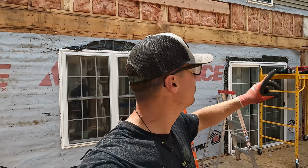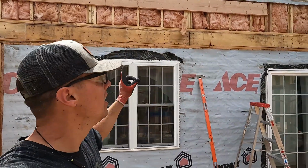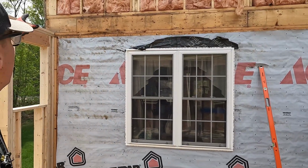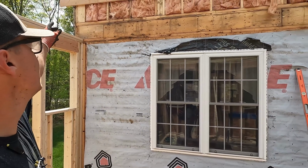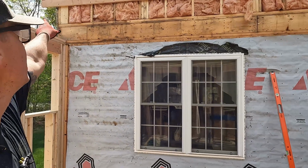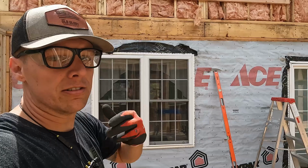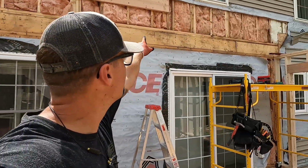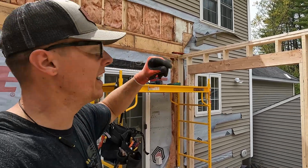So our walls are all done. We stripped back where our ledger is going to go, and we actually have a long part of our ledger on there. We have a 1 foot overhang from the first rafter, and then our layout's on there, 16 on center. We have 6-inch timber locks in each bay between our rafters, so that's not going anywhere. We just have about a 10-foot section left to cut over here with the 1 foot overhang.